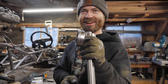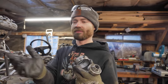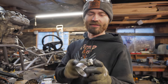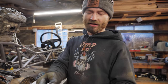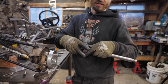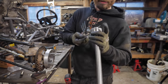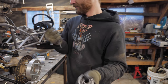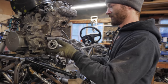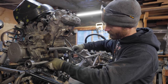I took away a little bit of material - that was a sprocket hub from some version of Cinderella's drivetrain. I stuck it on the lathe and turned it out to fit over this bearing, then just left the set screw hole in there so it slips on and you can set screw it in place. As soon as I get some mounts done we'll have a complete lower steering column.